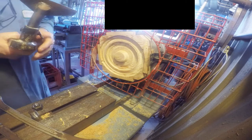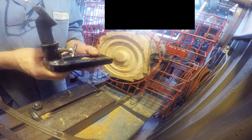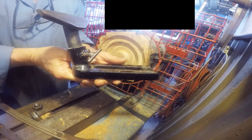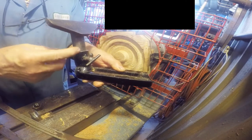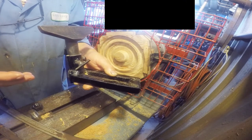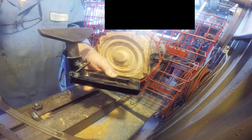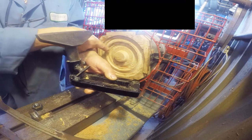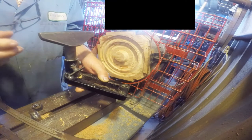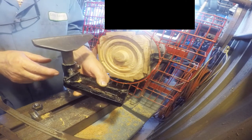So there's the tool post. I don't know if you can pick it up on the GoPro — yes, you can see I've got an angle here now, which means it's over centre of this point, which could cause problems. It could cause a little bit of chatter — I do have a little bit of chatter, but it's minimal. It's only when I'm doing the surface and this edge here — very minimal. If you take lighter cuts, no problems at all.